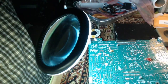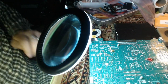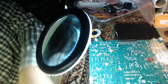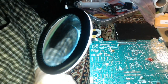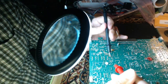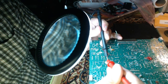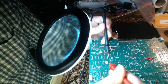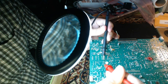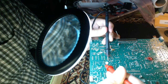Now here's what I'm going to also do on camera. I always check these for continuity, and being a transformer, you're going to double check all of them. We are on, alright, I got my multimeter on. You'll hear the tone. I'm just touching them together. Here we go. That's one side. That's the other side. And now I'm going to go opposite.